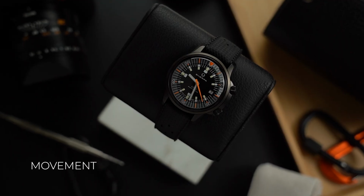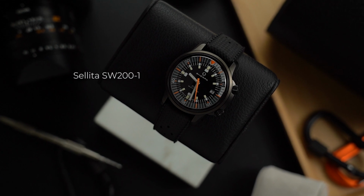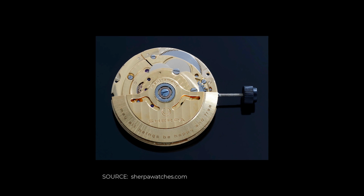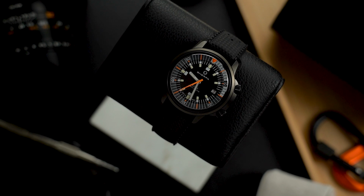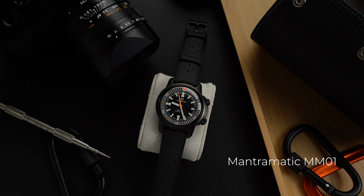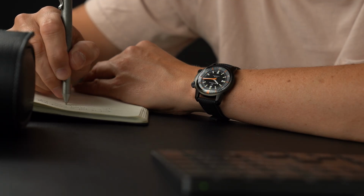Inside the watch is a more modest, yet tried and tested Sellita SW200-1 with a 38-hour power reserve. It's a premium version of the movement with gilt finish and custom decorations like Geneva striping and perlage, with a custom-built tungsten rotor. The brand founder is a practicing Buddhist, and to find a way to connect to the legacy of the Sherpa, that are also Buddhist, 2 of the movement wheels have been micro-laser engraved with a Buddhist mantra that acts as a Tibetan prayer wheel.